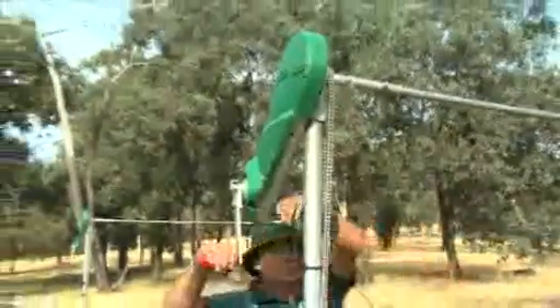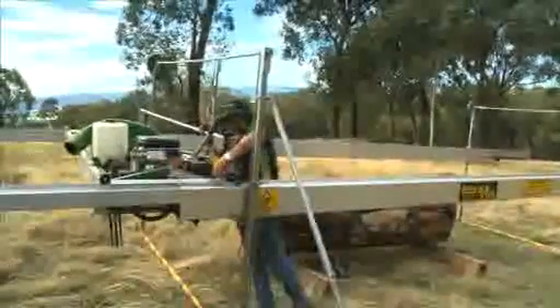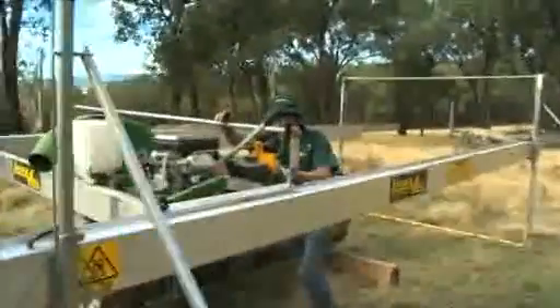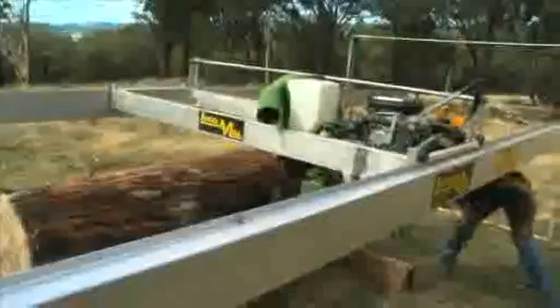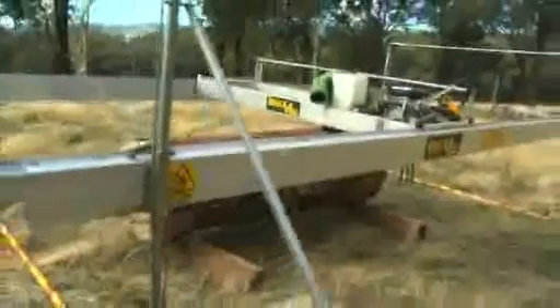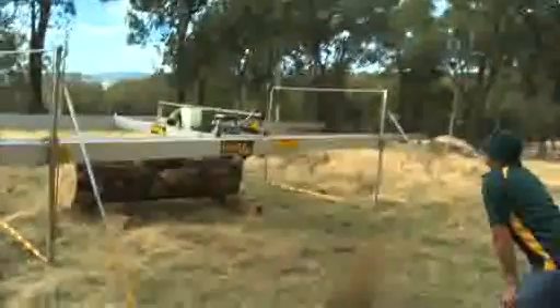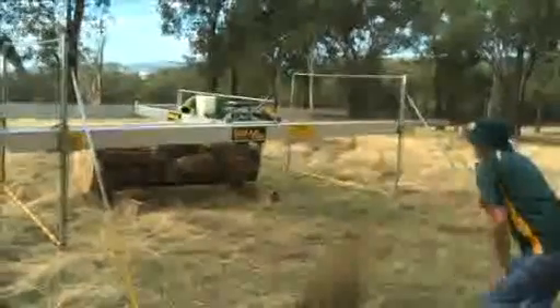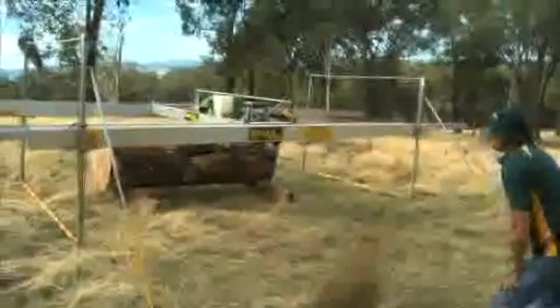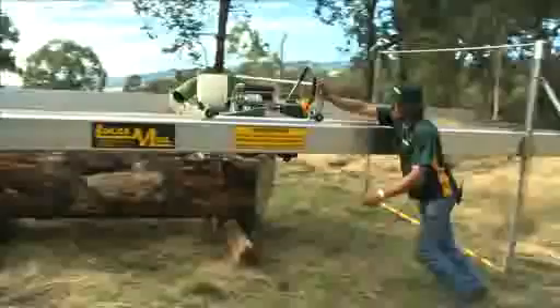What we've got to do now is wind this up so that the power head is above the log — same at the other end. The saw will operate in a downhill or uphill position, and it'll also work on the side of a hill leaning left to right, but we really must get all the twist out of the two tracks. Put the power head in the middle, step back out to the side, and run your eye across the top of the track in front of you and along the bottom of the track behind. You can quite easily see if there's a low spot — I can see one just over here on the left hand side. Come back over, find yourself a stick, lift up, and roll it in. If it's a little heavy, move the power head right down to the other end.